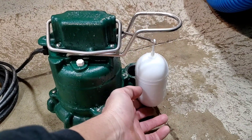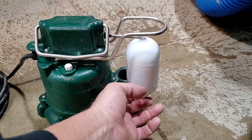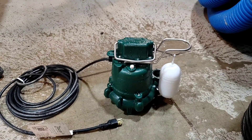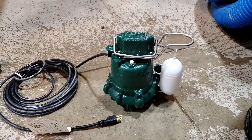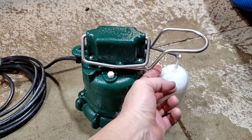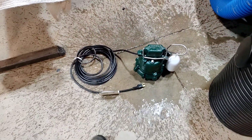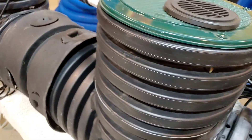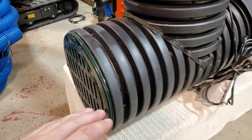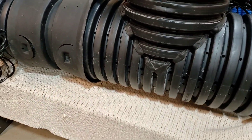I just showed you how five gallons of water triggers this pump — like five gallons in a cup. It runs that out, then five gallons fills it, runs it out, five gallons fills it, click, runs it out. Think about that — five gallons at a time. 99 out of 100 sump pump failures are in the switch, the mechanical float mechanism. It just gets overworked. I'm not a guy that runs around in a van charging service fees, so I'm not big on replacing sump pumps. I designed a system that holds hundreds of gallons.